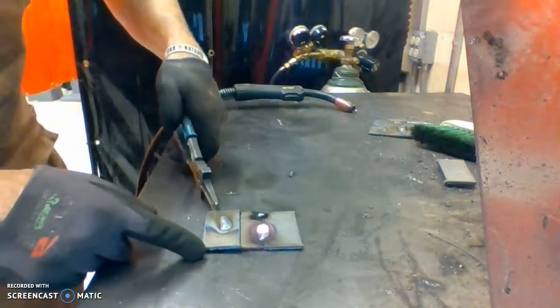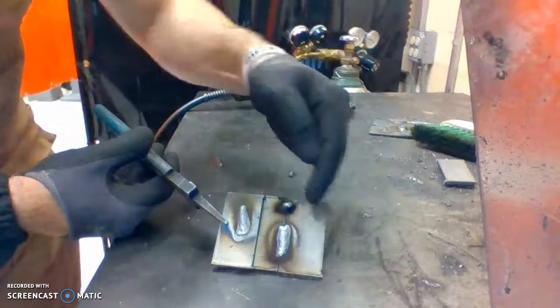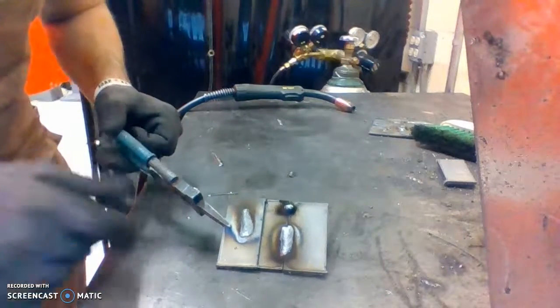What I'm looking for here is to keep the gap in the metal minimal, because you can't weld air. So get the metal edge-to-edge, hit the heat on both sides, get a smooth face, good toes, even legs — edge-to-edge.